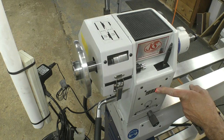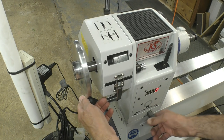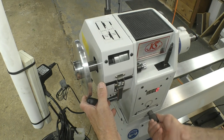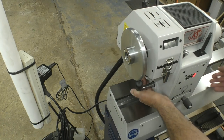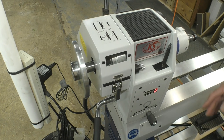You've got your speed readout here. Then here you unscrew and unlock the headstock and pull it out and swivel should you so wish, or leave that in and when it's locked and you want to slide the headstock, you merely push it to the end of the lathe or wherever you want and swivel at the same time. All moves very nicely. When you've moved it like this, this is when the double-ended Morse taper comes into play where you can realign everything up for centre turning.